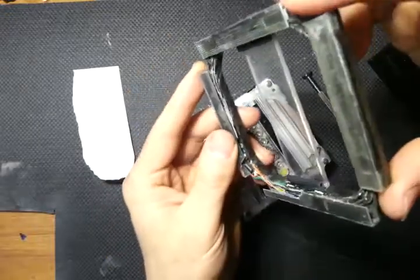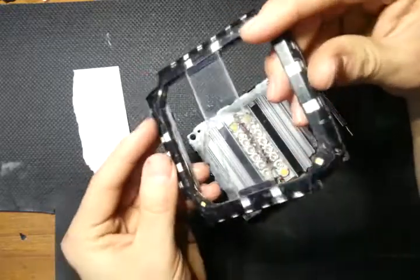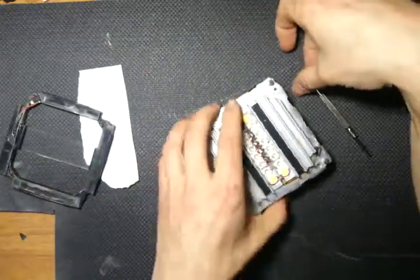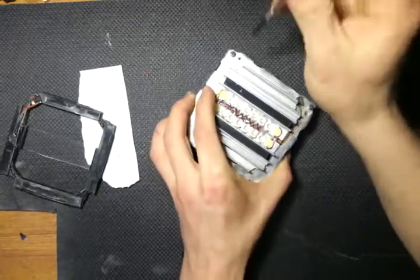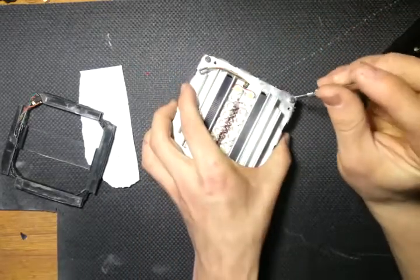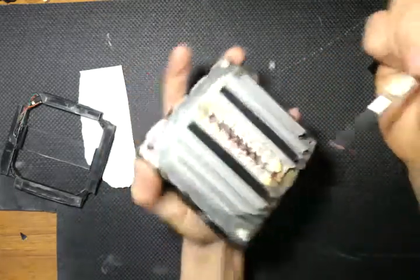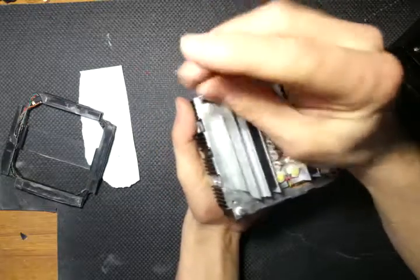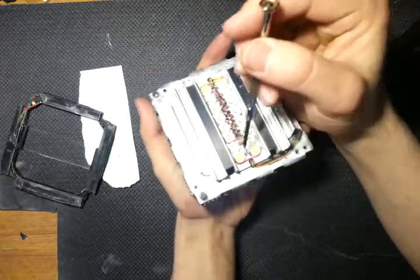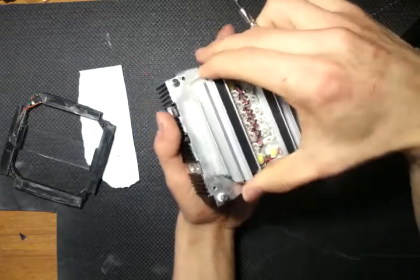You can see the mini connector and all the wires in there, and there are pictures of that whole thing being put together. Several LEDs on the side also. That was probably the hardest thing to do in the entire light — a very lightweight ring. It all docks into this mini connector right here. The LEDs are all housed in a heat sink in here. I have four white LEDs — two here and two here — followed by two on each side of the ultraviolet, and then in the middle, eight RGB three-watt LED beads.